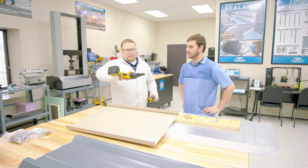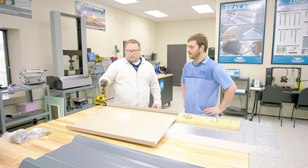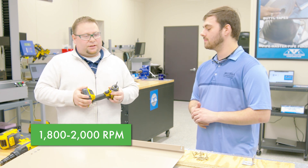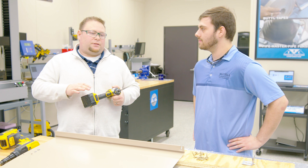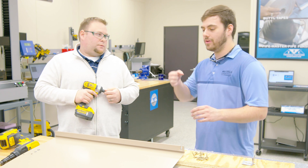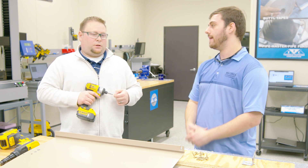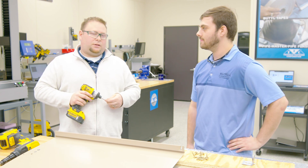These tools are designed ergonomically so you get the force behind installing a fastener. As for RPM speeds, we say 1800 to 2000 is ideal. Anything over that, you're really going to just burn out the tip of a screw. You want the screw to do the work for you along with the tool. We've seen guys really putting all their force trying to install a screw and it's just not going in. You want to let that head do its work and insert. Also, a lot of people like to stab into the material, and that's really just going to damage the tip.